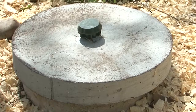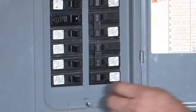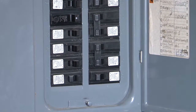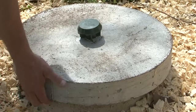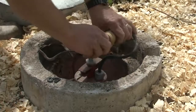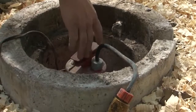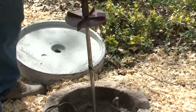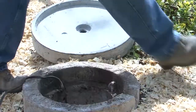Now we're going to install it and take the old one out. I went in the house and cut the main breaker in the panel box that goes to the timer and then feeds the aerator. I don't want to take any chances on the timer kicking on. I know I have no power because I checked it with my meter and shut the main breaker off.